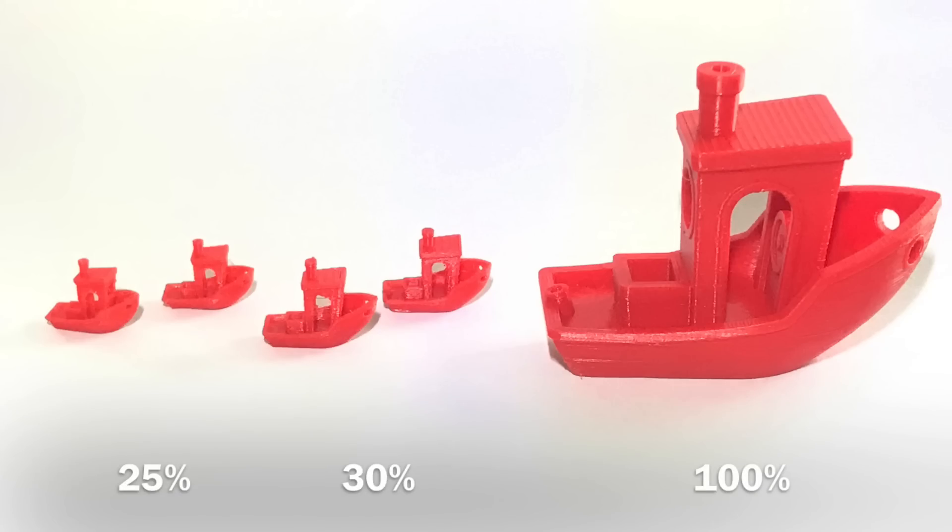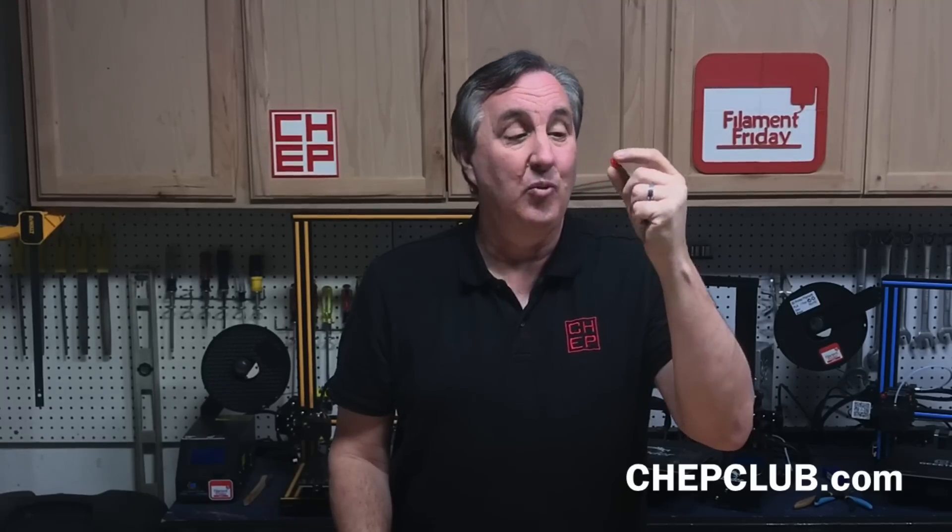This was a lot of fun and I'm really shocked how well it printed. After trying out that setting, I'm really impressed with how well a 0.4 nozzle prints on an Ender 3. I did not think these Benchys would come out — when I started I thought I'd get blobs. To get this much detail from a 0.4 nozzle on an Ender 3 is really impressive. In fact you could print your own Monopoly pieces with this and they'd be acceptable. I know I didn't show how to get really good prints with the 0.2 nozzle, but the fact is I tried a lot of different settings and even other people's profiles and couldn't get much better than the 0.4 with the thin wall setting.